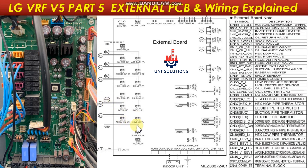The inverter sump heater is connected at CN12. The valve for oil to return from the accumulator to the compressor is connected at CN13. Inverter sump 1 heater is connected at CN11. Oil level sensor 1 is connected at CN1.